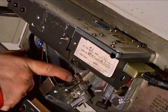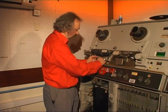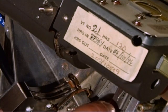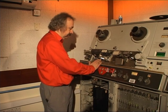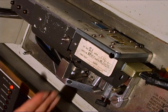Air is supplied to the machine for the air bearing. It also goes past a venturi which generates a vacuum, applied to the two thin slots. So the tape is actually sucked against the guide and then pushed in against the head. The guide itself can be moved up and down by this control here, and also moved in and out electronically.